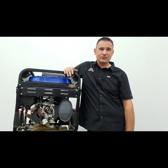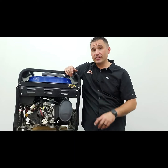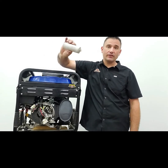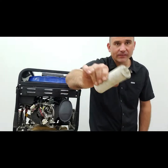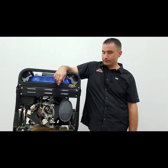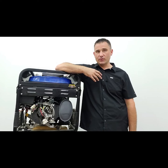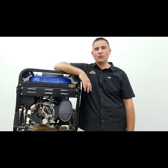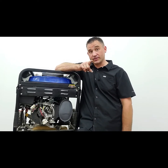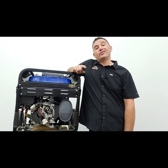There are a lot of YouTube videos where they'll put a drill on the generator and spin it backwards to restore power - that doesn't work for all generators. It only works for brushless generators with a capacitor inside. For AVR brushed generators like this one, there's no point. But to be clear, the drill method does work on brushless generators - I've done it personally, customers will bring one in and I'll do it and it blows their mind. Just not on voltage regulator types like this.